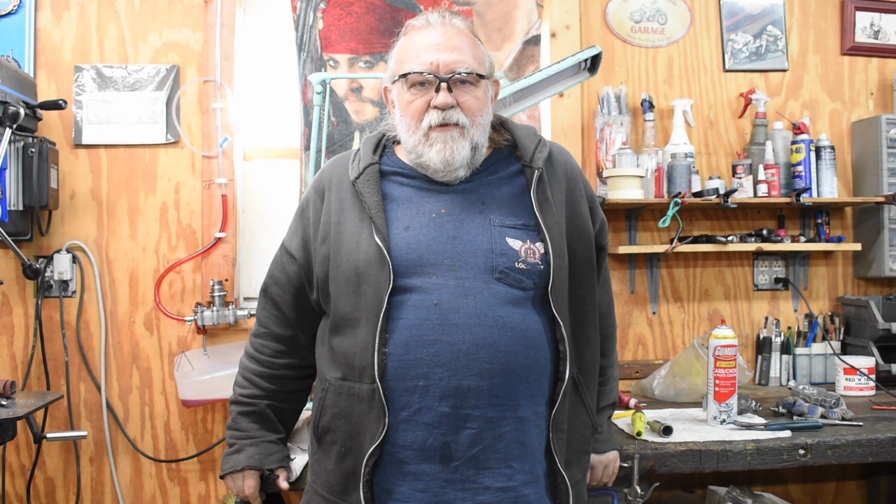Well, every good story has to come to an end sometime. So I think we're going to call this the end of this video series. The goal when it started out was to identify where the oil getting blown out of your crankcase was coming from. So I think I positively identified two sources, one of which was the one people are always suspicious of, oil oozing past the outlet check valve on the pump and into the oil galleys and just seeping out everywhere and eventually filling up the cam chest. The other source, not commonly suspected to be a problem, was the drive shaft for the rotary breather. That thing leaked like a sieve.